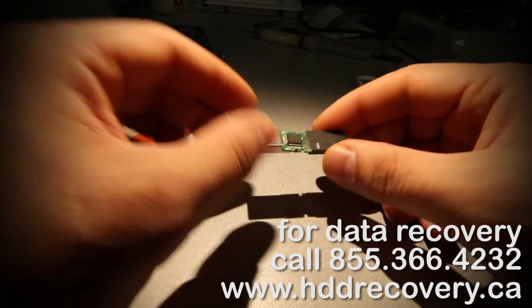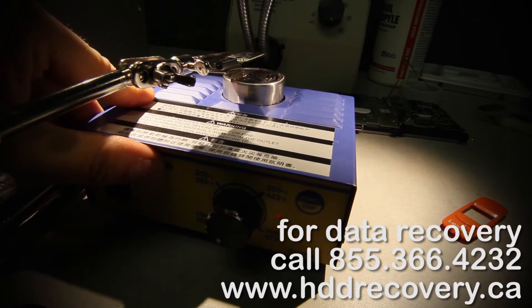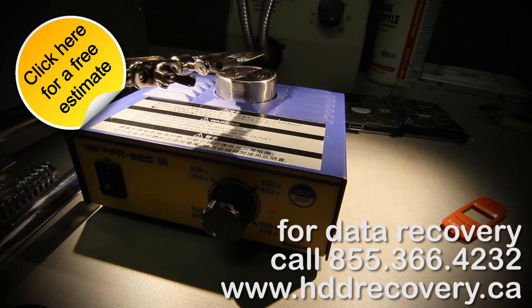The first step is to use our preheater. This is a 32-gigabyte device, and the most time-consuming portion will be reading data directly from the chip. We'll let it preheat briefly, then turn the heat up to 200 degrees Celsius and begin applying heat from the top using our rework station — in our case the HAKKO 850D. It's a digital system, a bit of a dinosaur, but it works well. We'll use the BGA nozzle on top to help release and melt the solder underneath the component.